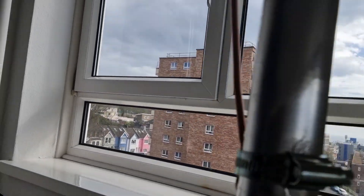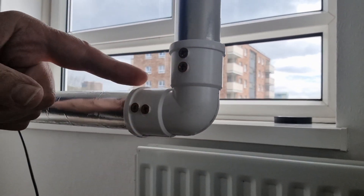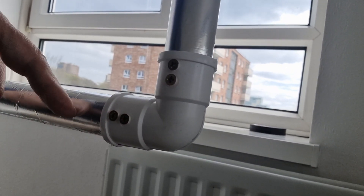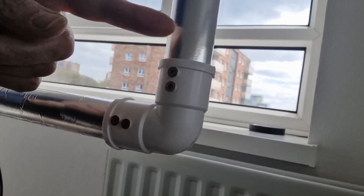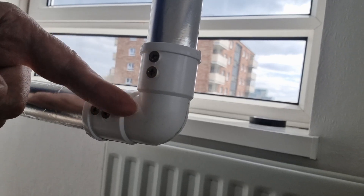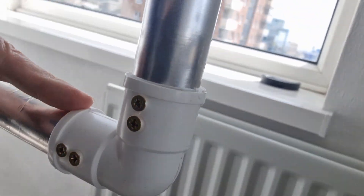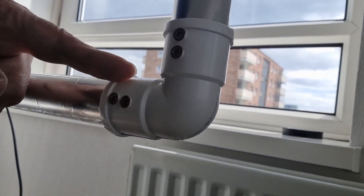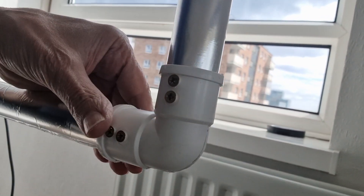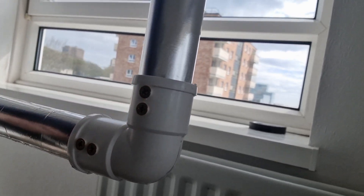The corners of the loop are made using plastic 90-degree pipe sections. We need to have electrical conductance between the different parts of the loop, so I lined the inside of these by cutting them in half with a hacksaw and then putting aluminium foil inside so that when they clamp back together again contact is made for a continuous loop. I just drilled holes and put screws in to hold it all together.